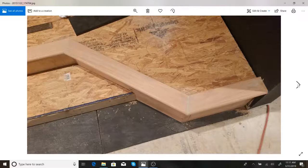To trim it out I used three-quarter inch hardwood bullnose flooring from Home Depot. I would have preferred something other than hardwood but that's all they had — you could also cut your own and round the edges with a router. I ran the bullnose along the top edge of the stage and also down at the step. I attached it with subfloor adhesive and a nail gun. You don't want the bullnose touching the wall either.